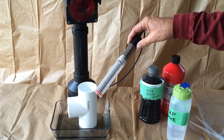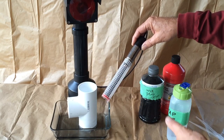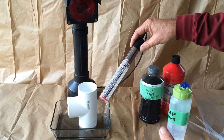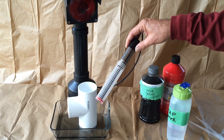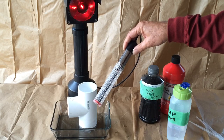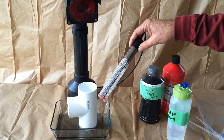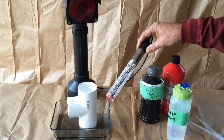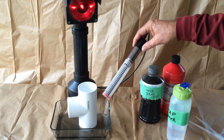For a heavier oil, or particularly for a crude oil, you might actually need to dip the sensor into naphtha several times, diluting the crude oil until it runs clear, and then eventually the naphtha that you're using to dissolve any heavy oil or crude will evaporate and the sensor will reset. So the sensor is reusable many times, both after hydrocarbon detections and after brine detections. And as you saw, it will pretty well ignore rainwater or condensation or snowmelt.